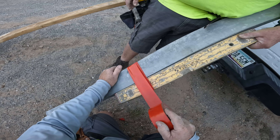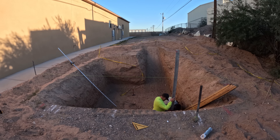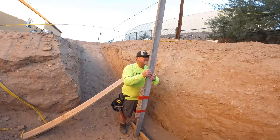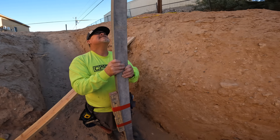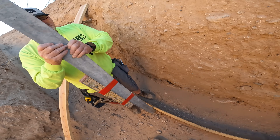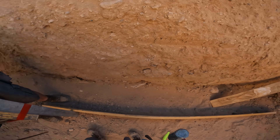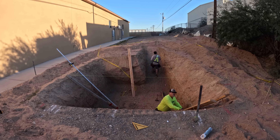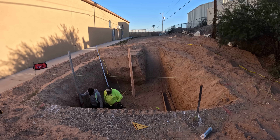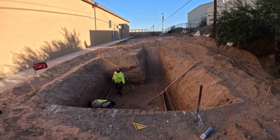Here's setup time. I've got my string lines up, went parallel off the building, squared up the line, and now I'm plumbing down off of the string line above to form the bottom. If I form the bottom perfectly in the right place and square to where the pit's going to go, I won't have to plumb down ever again — I can work off of the bottom slab.